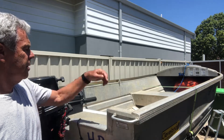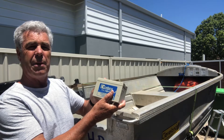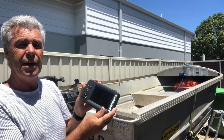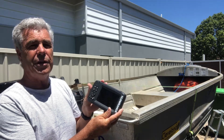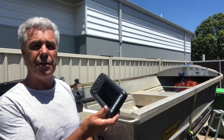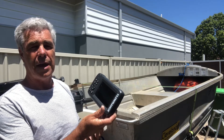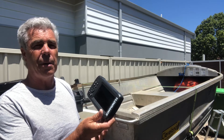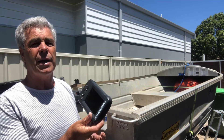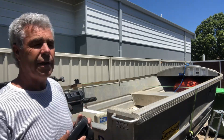Up until this point in time, I've had a tiny little battery like this — about 10 amp hours — which I just had mounted on the seat, and this was my sounder. Now that little battery, even though it's only 10 amp hours, it's going to run this for 8 to 10 hours of fishing. This particular thing draws about 1 amp hour. It's a combo sounder — color sounder and GPS. Other sounders are probably going to be doing similar things; maybe screen size might impact that slightly. I can get out for 8 to 10 hours of fishing, and I normally don't go fishing for more than 3 to 6 hours in a tinny like this, so that's been more than ample.